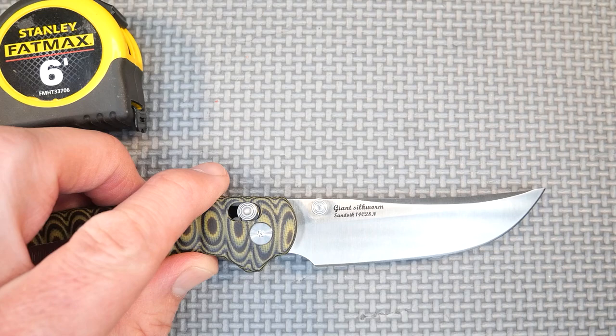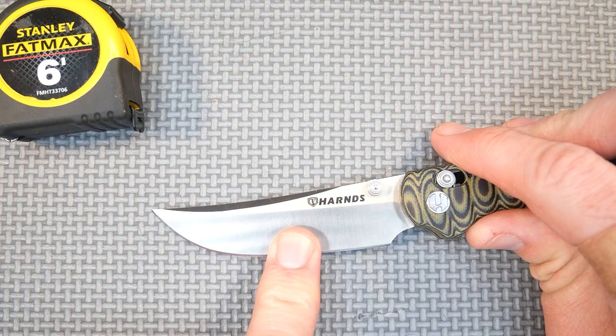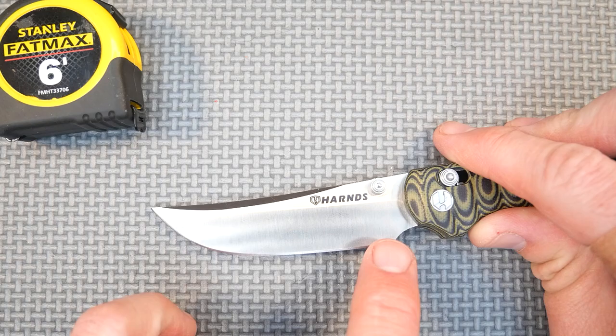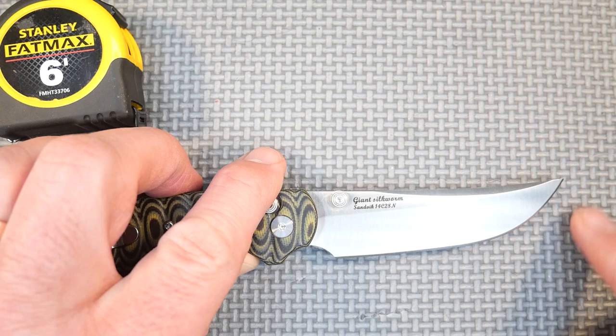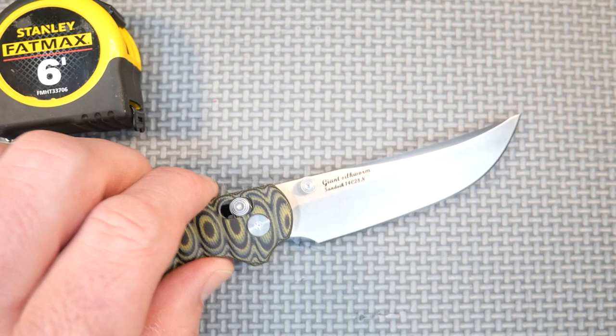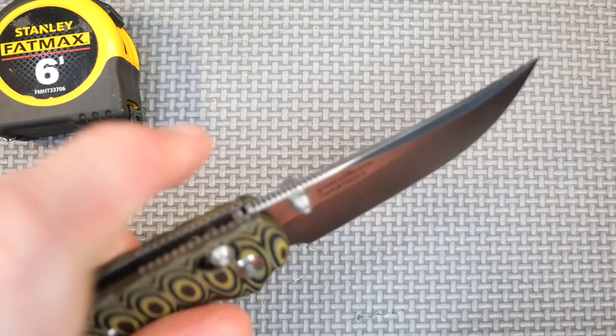The grind angles — this is one of the reasons why it's not all that very sharp. On this side in the middle section: 14.5 degrees. On this side in the middle section: 28.2 degrees. But it gets worse. This side starts off at 20.6 and ends at 29.7 — so almost a 10 degree change, 9.1 degrees actually along the length. And on this side, it starts off at the tip at 20.9, then 14.5, then 20.5 — so it goes back and forth. Just like most knives, they're not always sharpened very well. They might be sharp, but they're usually not sharpened all that well. With 14C28N I'd probably sharpen this thing to 18 degrees per side and use it like crazy.